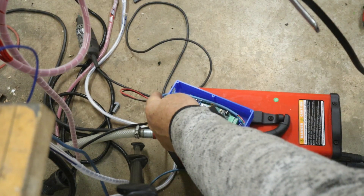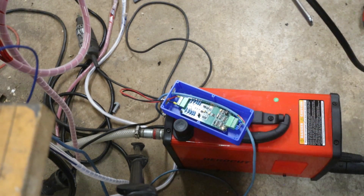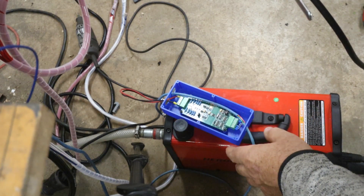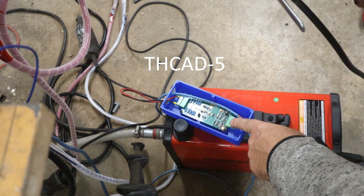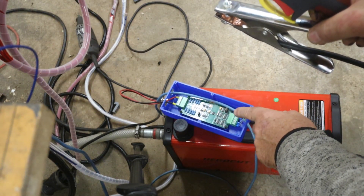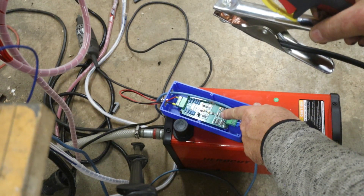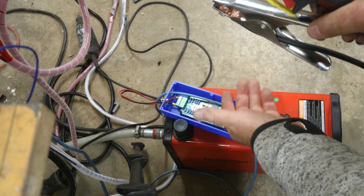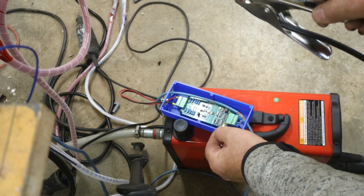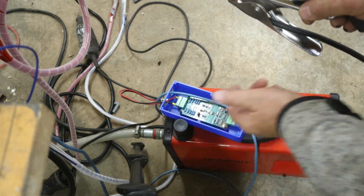Because this one has the 300-volt output directly - it's a non-scaled output from this plasma cutter. Many other plasma cutters have resistors in series and you have to do a little bit more work, and you should select another one - a 5-volt or 10-volt version. What this one does is take the 300-volt input, convert that into a frequency - say 30 kilohertz for 300 volts and maybe 10 kilohertz for zero volts. The electronics over there can easily count the frequency and thereby determine the voltage, and then you can control the process from that.